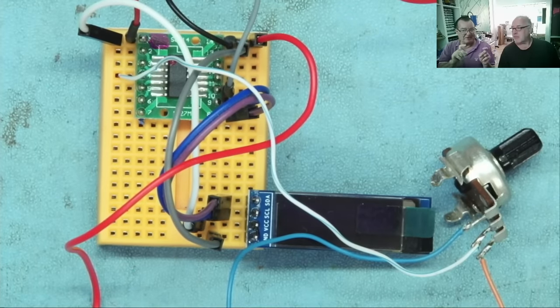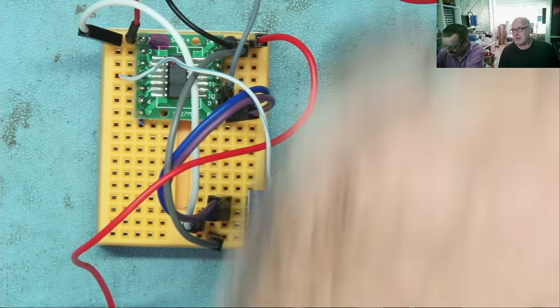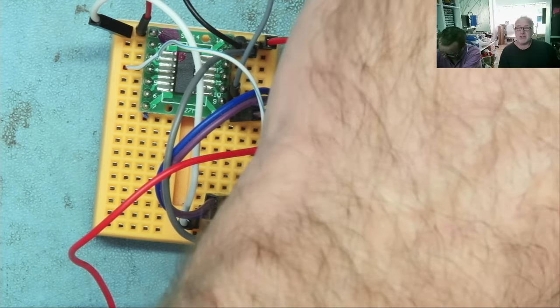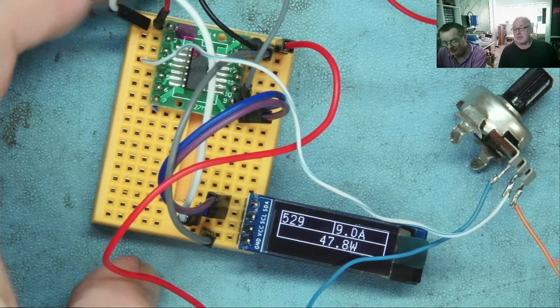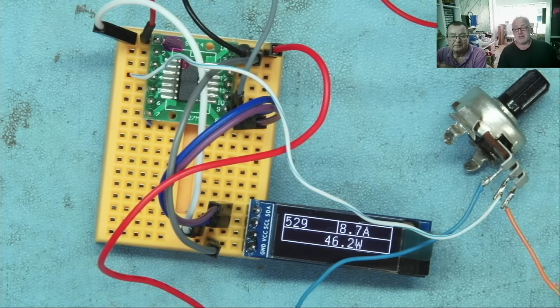This is a working thing. It's a work in progress, a proof of concept, I'd call this. You can already tell there's a little CPU. This is an ATtiny 1614, so UPDI programming again. The 16 in the name of the chip tells you this is 16K of flash memory. I'm already at 90% with what the little CPU does right down there, so we need the 16K. 16K is close if you want to do an OLED with that.